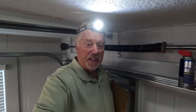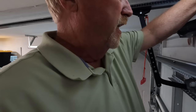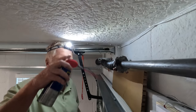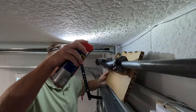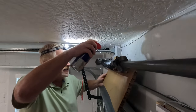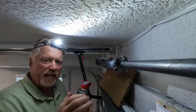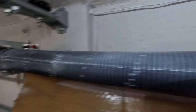What I did is get a little stool to stand up on. If you have a problem with heights, maybe you want to get a handyman to do this. I got an old piece of cardboard to stick behind here. What you want to do is just kind of loosely spray on the top of the spring. I got this piece of cardboard to keep the spray from going all over, and I'm using the front end of the can — not the little tube. I'm just going to hit the top of the spring, and that's about it. You can see I got just along the top of the spring, and that's all you really want to do.